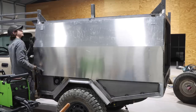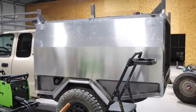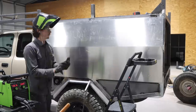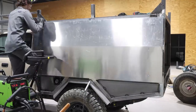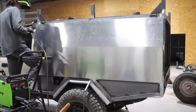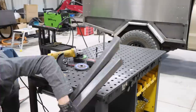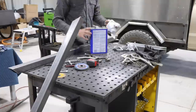I wasn't able to find exactly what I wanted so I had to make my own hinges. I found a piece of stainless tube that fit a half inch bolt perfectly on the inside — that's what I used for where the bolts connect into, and they didn't powder coat on the inside so we have a nice little hinge there. It worked out great. Some things are working good and other things in the project weren't fantastic, but you've got to take the good with the bad.